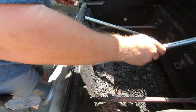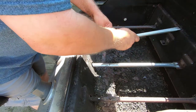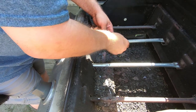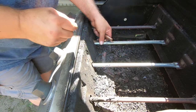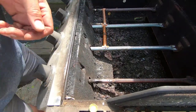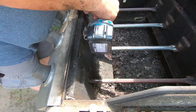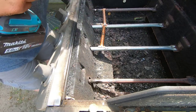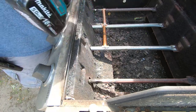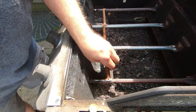Now I'll reinstall the tuned burners and install the carry-over tubes. You may notice that there are holes drilled in the last two carry-over tubes I'm installing — don't drill these holes. This was part of the trial I was doing to see what would work; they did not work, so don't drill the holes. Just cut the bottoms out like I showed you previously. These tubes still work but I'm going to remake them because it takes a little bit longer for those two burners to light.